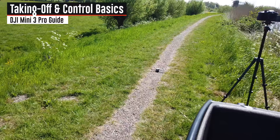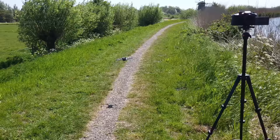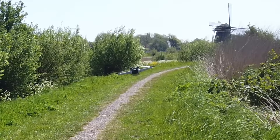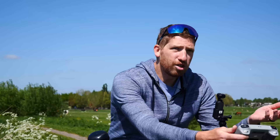There are two ways to take off. You can press the takeoff button on screen and hold it for a couple of seconds — the props spin up and the drone automatically rises to about one and a half to two meters and hovers. Once in the air it uses its downward-facing sensors combined with GPS to maintain its exact position. I usually press record at this point so I don't forget later.